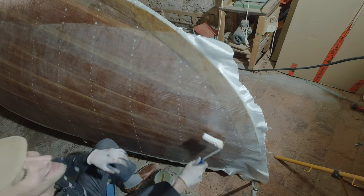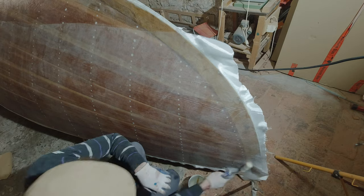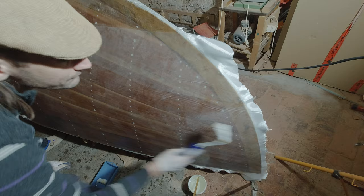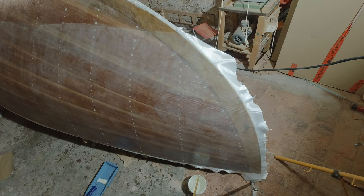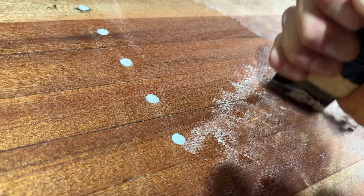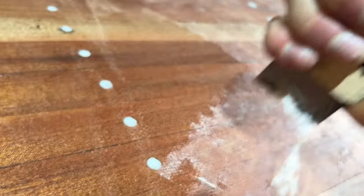Only to wake up next morning with doubts and finding the epoxy still not cured. The room temperature seemed to be okay. And when that was okay, something else must have been wrong. The mixer. It struck me like a thunder. How the heck could I miscalculate? Instead of 100 to 40, I mixed 40 to 10.